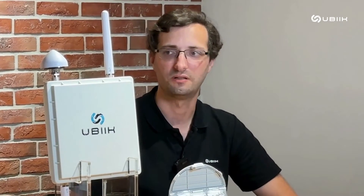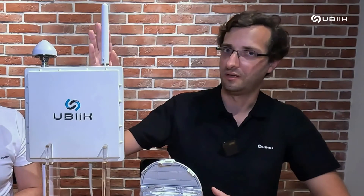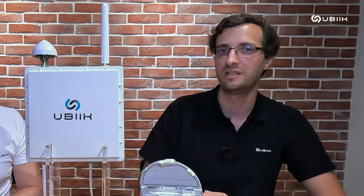This is FreeRun. As you see, it's a compact LTE-M base station operating in the unlicensed band of the United States, which is from 902 to 928 MHz. It's already powered on — it's powered over Ethernet, as its low power consumption of less than 60 watts allows this. It's equipped with an antenna through which the devices communicate with the base station. The base station broadcasts an LTE signal at 926.5 MHz and receives from the devices at 903.5 MHz, all within that unlicensed band.